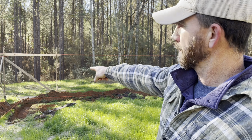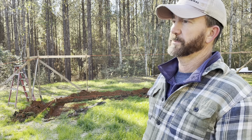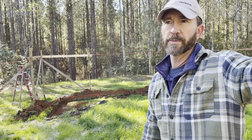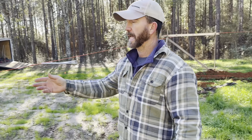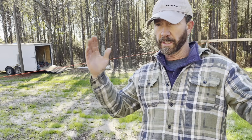What I did is I measured off of the property line and got the house square with the property line, and that squared it with the road. We're short a little bit of a curve, but it's close enough — I'd rather it be squared up with the property line itself. Anyway, I got these two lines established where I wanted them. These are running parallel, 32 feet apart exactly.